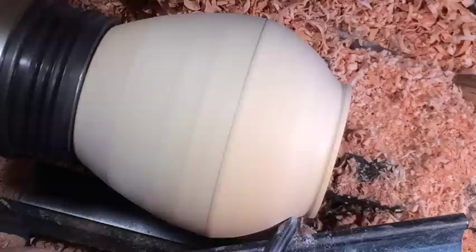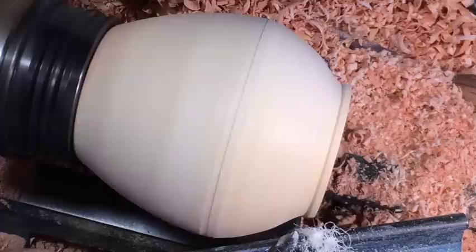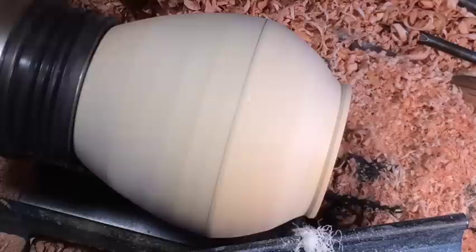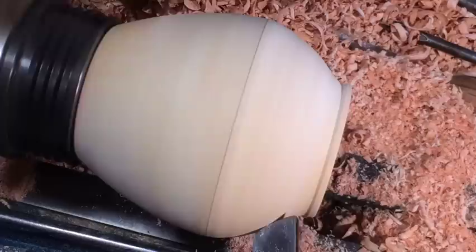You just have to get the whole of that edge in there, so the nose of the tool, you can just see probably a bit of dust there. So that portion is virtually shear scraping the underside of that little rounded bit. That's all it's going to get. And I've honed up my shear scraper here, and so I've now got what we can define as a little, yes, it is a little bump there. I'll shear scrape that out of the way.